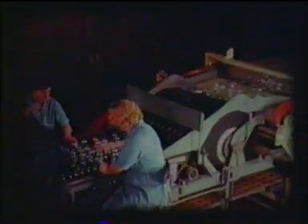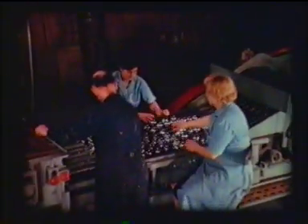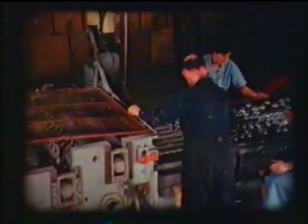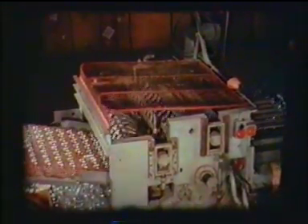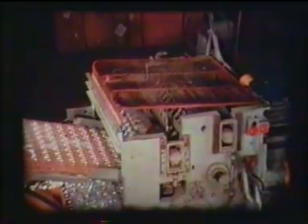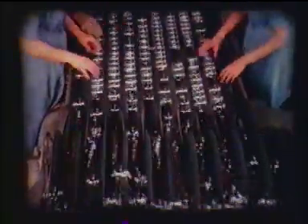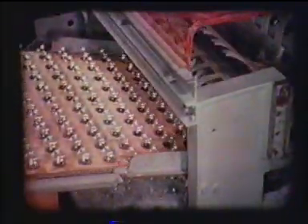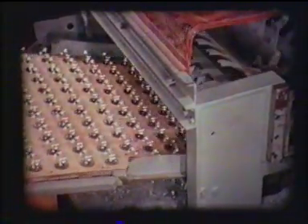In order to process them in the frosting plant, it is necessary to place the bulbs into trays. For this purpose, the traying machine was devised and inserts 100 bulbs into each tray automatically. The trays are received into the underside of the machine, whilst the bulbs roll off the belt through rubber dividers into lanes. The operators evenly balance the number of bulbs in each lane. The bulbs move along the lanes to be collected by a series of paddles, which move them down and with the aid of air pressure insert them into the trays.